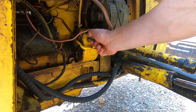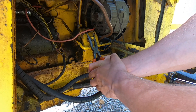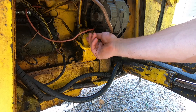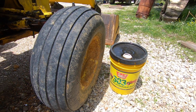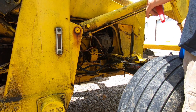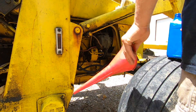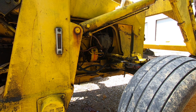At this point you can go ahead and locate the power steering reservoir, or if you're doing hydraulics, your hydraulic reservoir. Pull your plug and refill it to the correct level. This tractor calls for hydraulic fluid to run the power steering; however, I'm going to be using full synthetic automatic transmission fluid instead. Now that the reservoir is full, I'll start the tractor up and take pressure off of the front tires. That way I can turn left to right without binding up the power steering system and bleed out all the air.